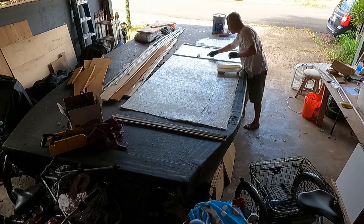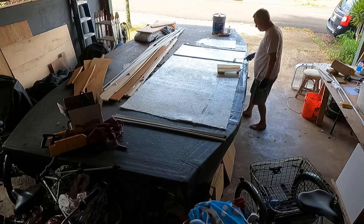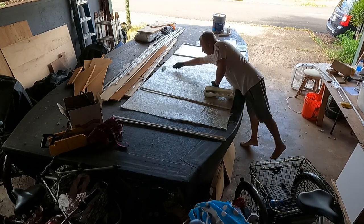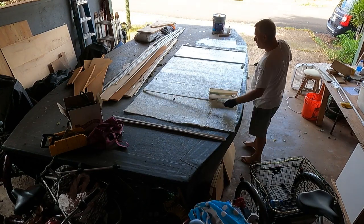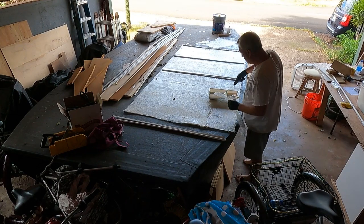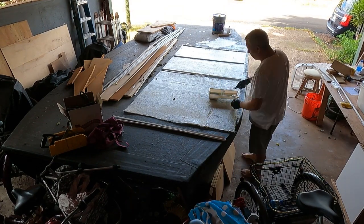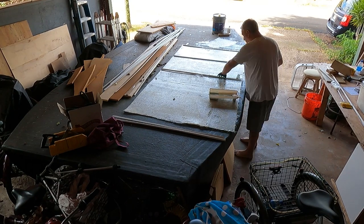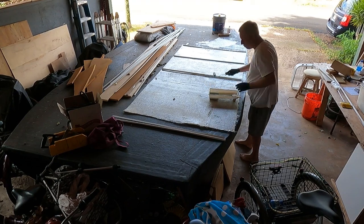I'm using sheets of fiberglass for this build because we're not able to get sheets of coroplast on Kauai. Coroplast is the plastic cardboard material that's used for real estate and for sale signs. Fiberglass is a bit more expensive than coroplast and can also be a little bit heavier, depending. So that's why I'm making sure that I make this structure as lightweight as possible, yet still have the amount of strength that we need for wall and roof panels.